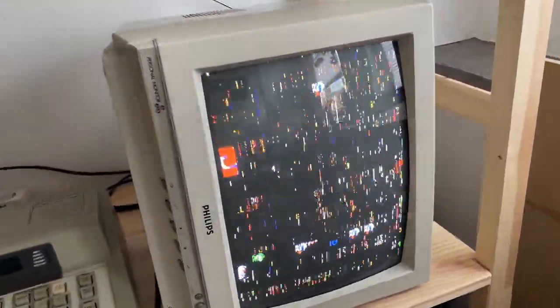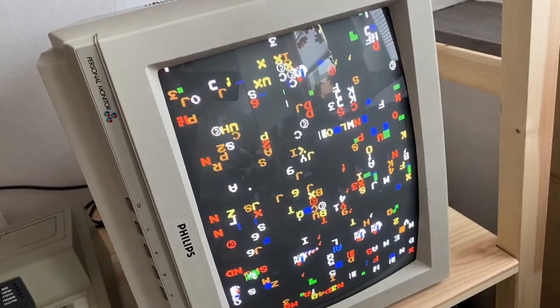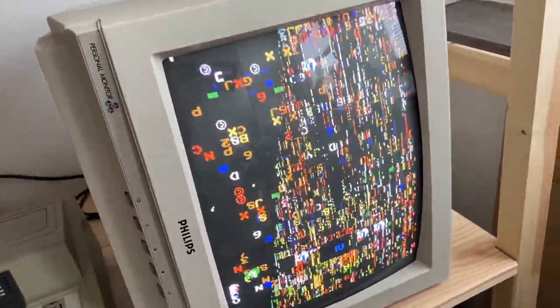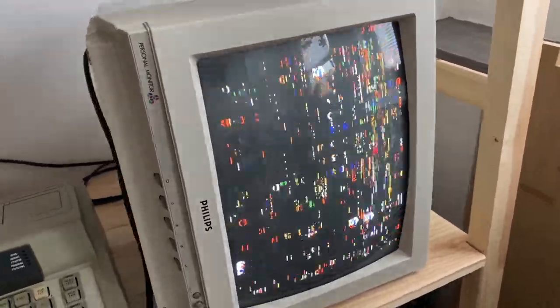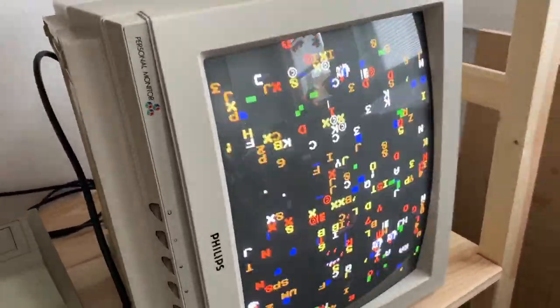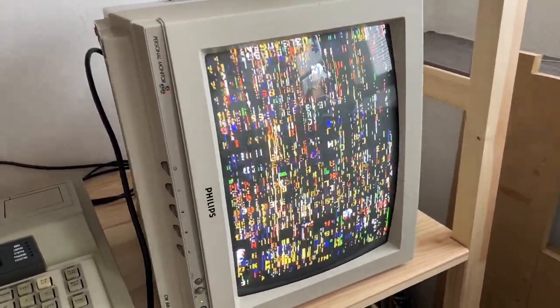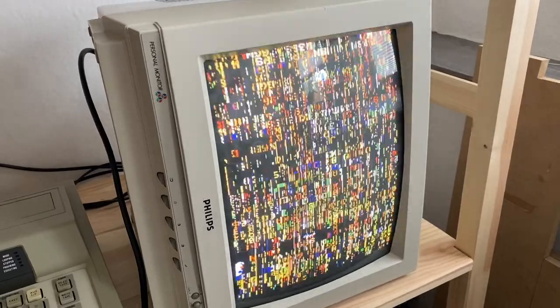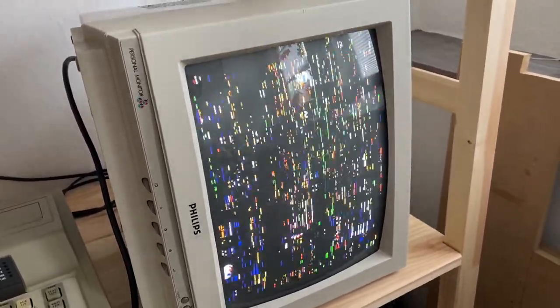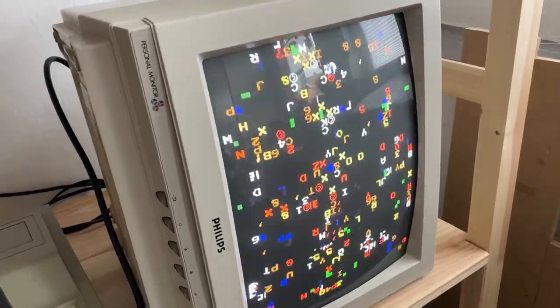Here's how the game looks with the RAM chip in place. We actually have a new layer of graphics on the screen. We still have some garbled items like before, but we now have a text layer which is also glitching up. What we can say is that this comes down to a CPU problem, because we have some graphics on the screen and some sounds, and the game is obviously watchdogging - meaning it is resetting over and over because it is not running correctly.